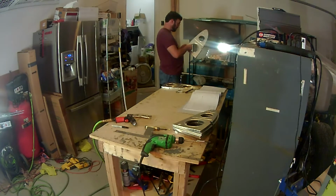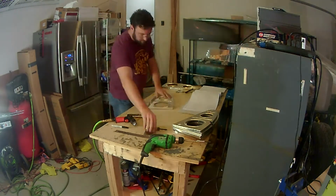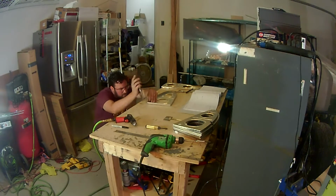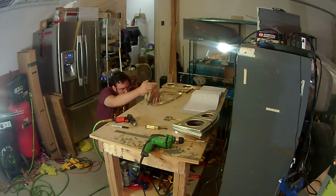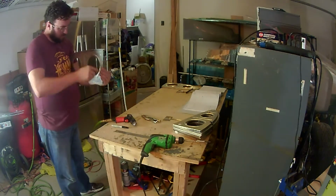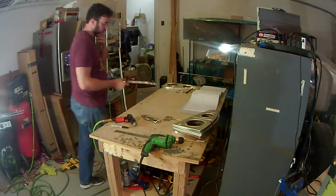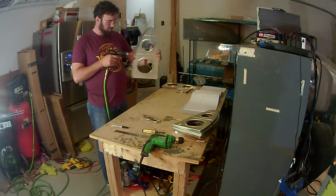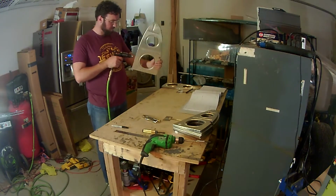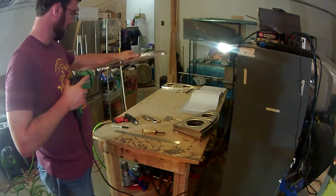So now I decided I'm going to work on the leading edge. I figured since I've already got the fuel tanks done, I can at least start working on the leading edge and just get the whole front end of the wing done, and get everything attached to the spar and be done with it. So I started doing the normal thing, getting all the ribs ready, deburring all the edges, the lightening holes, drilling the holes to a final size number 40 wherever they match up with the skins.